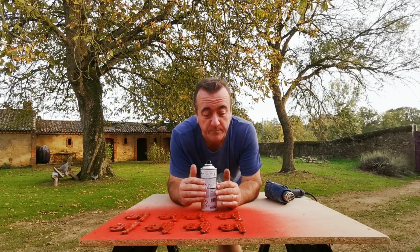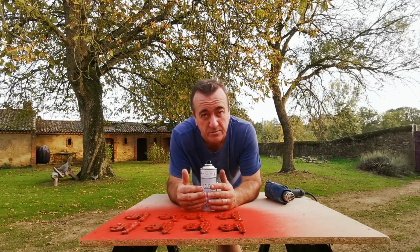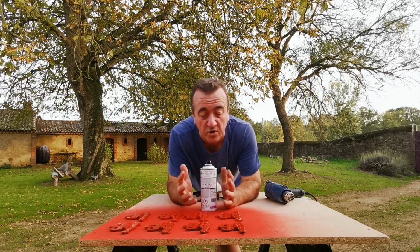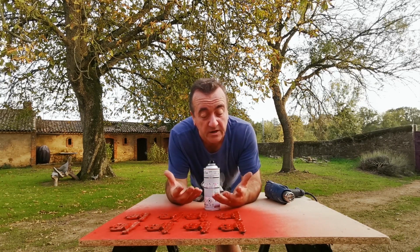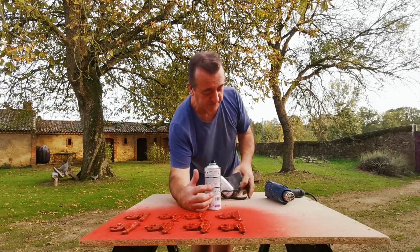If you try to do this in three thick coats, for example, you'll find that the bottom coat can often remain soft, because the air can't get to it to dry, because you've sealed it in with thick coats of paint. So I always try to warm each coat to let the drying process start. And then every time you spray, you're spraying onto a warm surface, because each coat is getting warmer. Respirator.